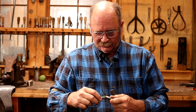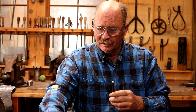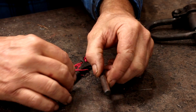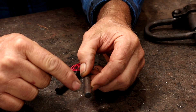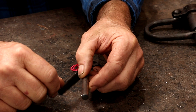So the key is completely functional, it's kind of ugly — I think I'm going to make another one. Because I'm onto day 3 of this video, later I'll make a whole new key and this one will go in the garbage. But I can at least use it as a sample to show you what I have in mind for the top of the key. This last one I did, I just split this with a chisel and then forged it out. This one I think I'm going to run through the bandsaw and put an open-ended split, open that up and then curl it around — either heart shaped or little scrolls or something like that — just to be a little bit different.